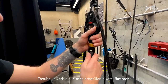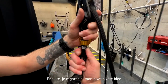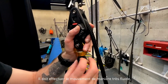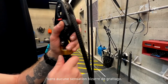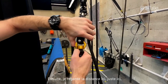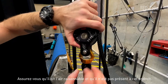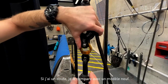Then I look at my swivel. I'm not super wary about the wear here because it's rope inside metal. I look if my swivel swivels pretty good — this has to move very fluidly without any grainy, sandy, or scratchy feelings. Then I look at the little gap that's in between my two swivel pieces, making sure it looks reasonable. If I'm worried, I will compare with a brand new one.